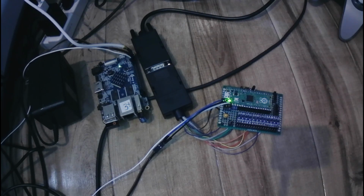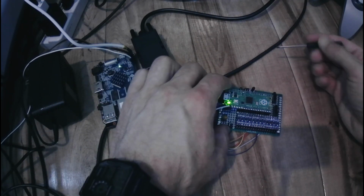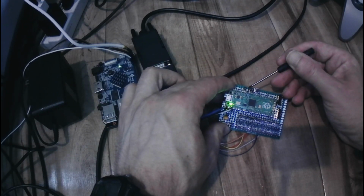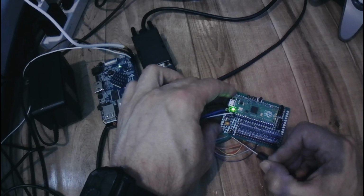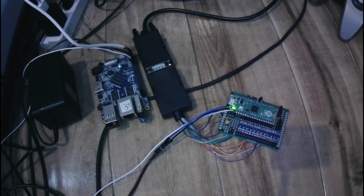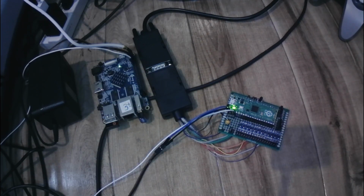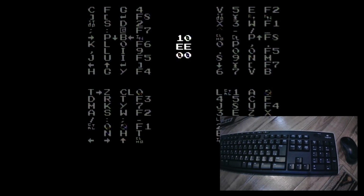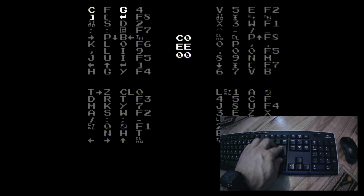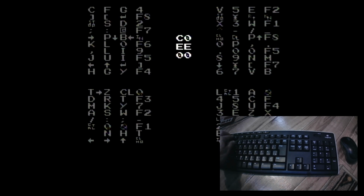The last mode is Family Basic Keyboard and Hori Track, set with 2 jumpers on both pins, and the controller port 1 data line 1. This is a configuration that is unusual with real hardware, but could be set up.